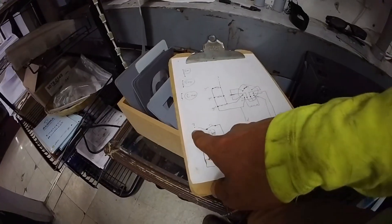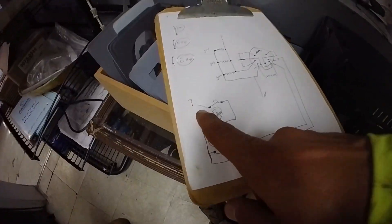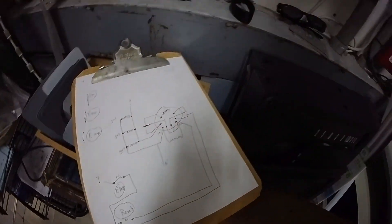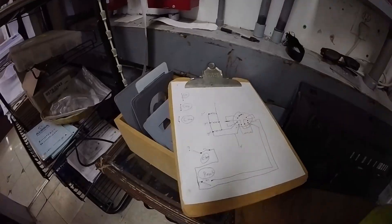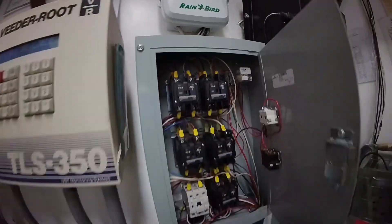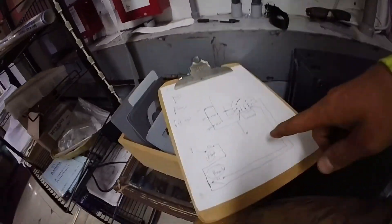We have this mystery wire that may just come from the breaker. And then there's this mystery red wire here that also goes down into the conduit to a mystery place somewhere out there. This is receiving 120 because all these contactors are powered — see how it's sucked in — and the relay is on.